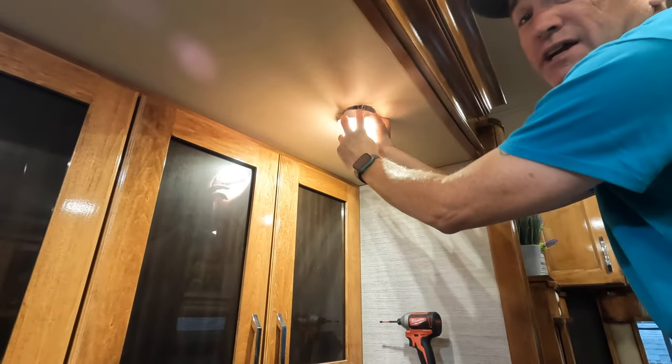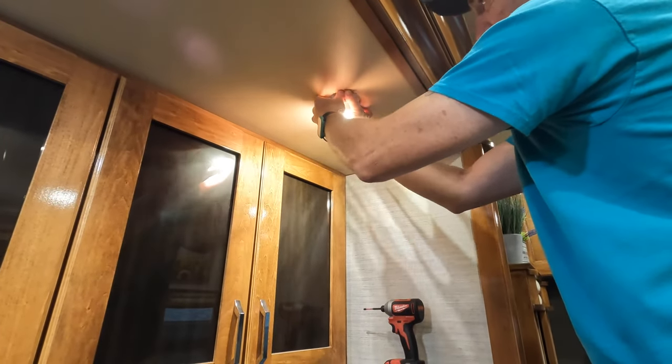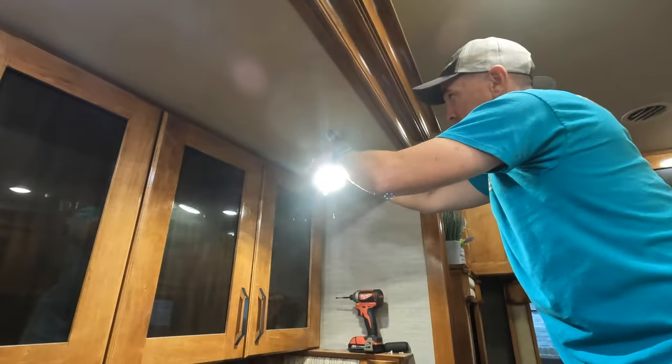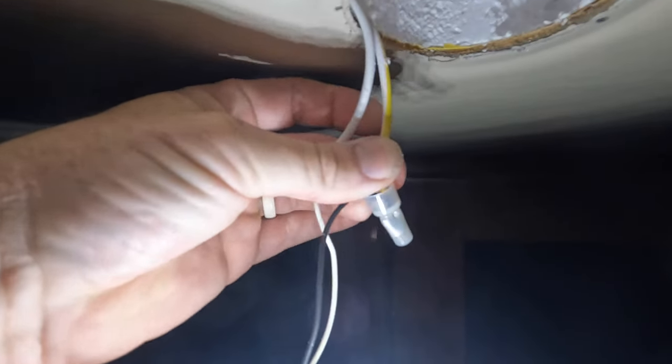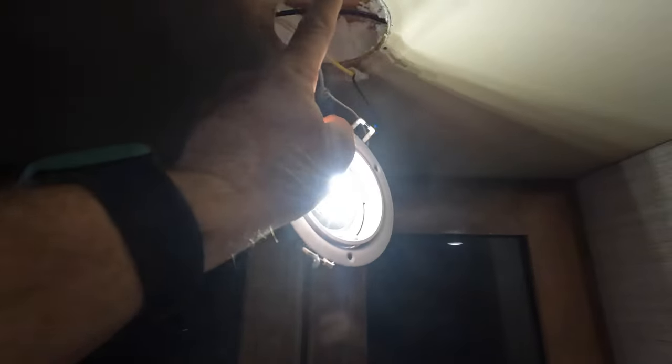You can see right here — here's that spring I was talking about. You've got to kind of push it back and bring it down. Now this is at the end of a daisy chain. You can see one wire is solid white — that's going to be our ground — and this is white and yellow, that's our hot. What we'll do is get these crimps off and put our new light on. You can also see the three screw holes where it mounts back up.